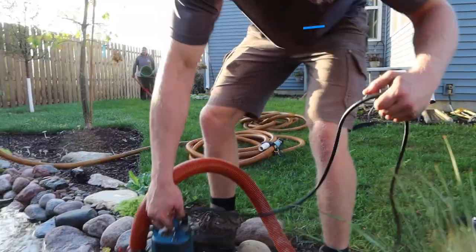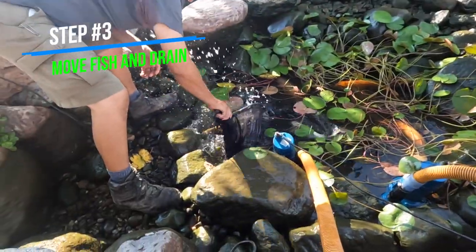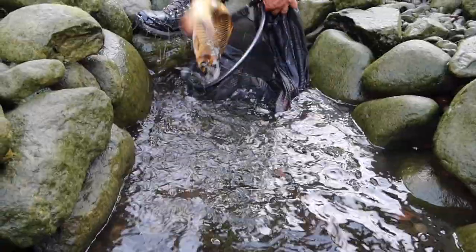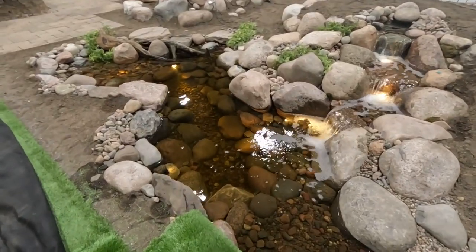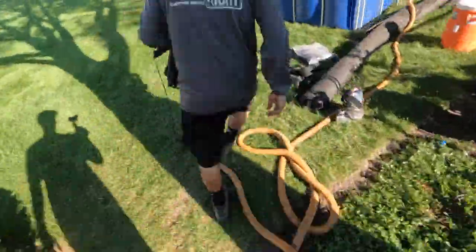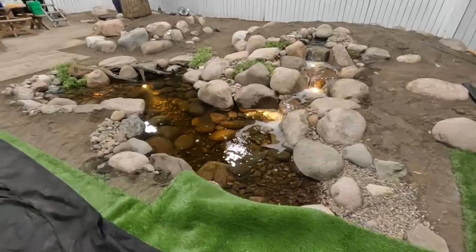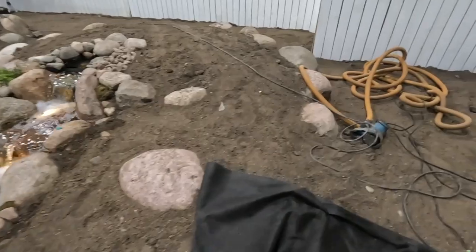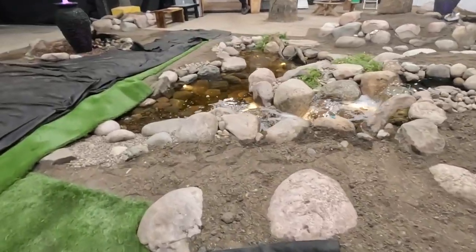Step three is going to be moving that pump over here and draining this water. Normally if this was an existing pond there would probably be fish in here if the homeowner did not take them out already. So we would come in here, set up a blue tank, drain the water from the pond into the blue tank, and then move the fish into our holding tanks. That way if the homeowner didn't want the fish they can take care of them, or we would just put the fish back in once we're done building the new feature. In this instance we're going to be draining this water into our clean-out tank sitting right over there — it dumps down into our sewer so we can discharge this water without making a muddy mess.